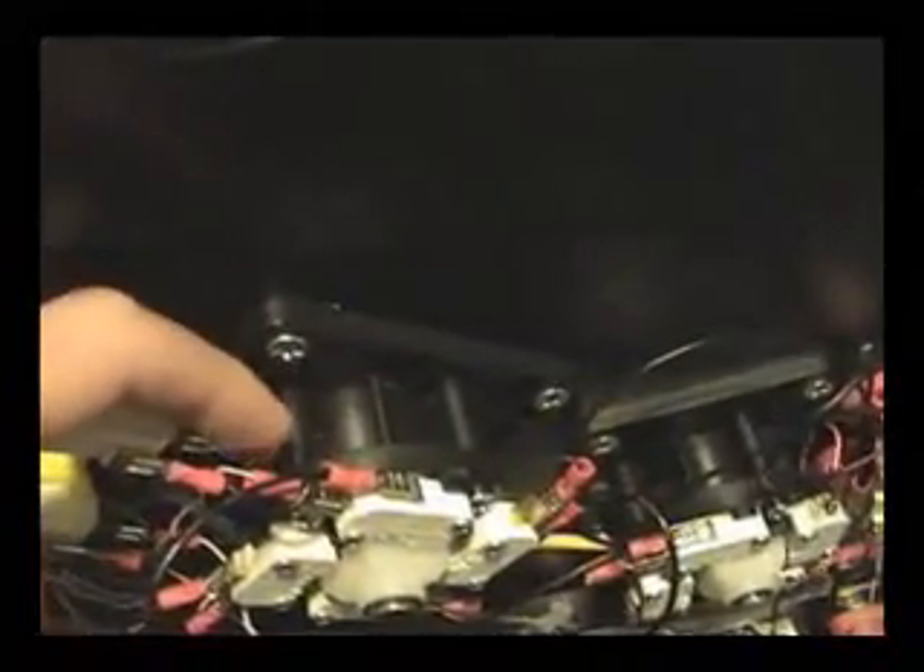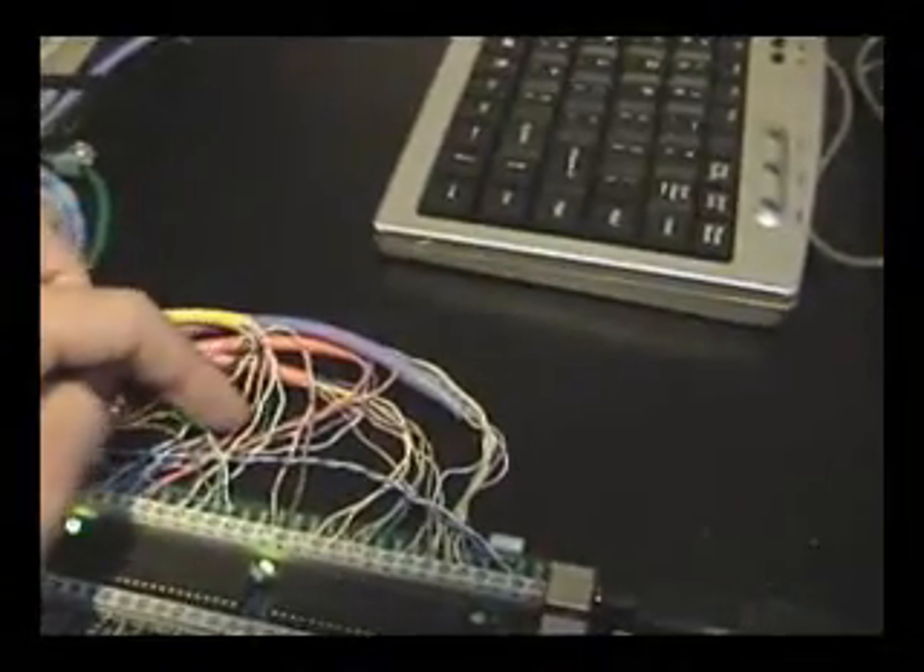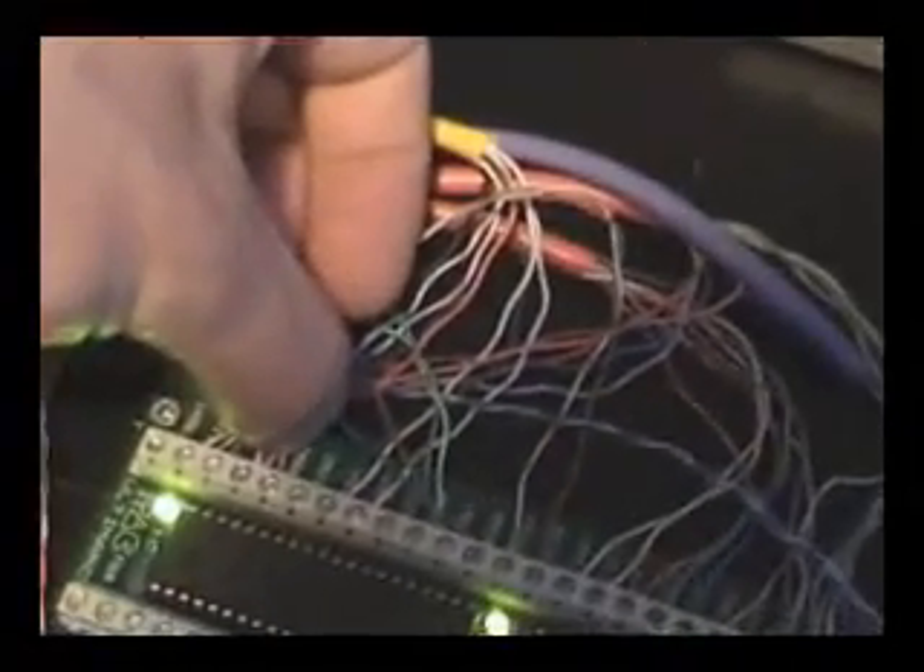Let's say you want to do button number one, which is this one right here. Now that everything's done with the ground, you want to get the pin — that's the pin you want — and that's connected to the yellow wire. In my case it would be the orange on the yellow wire. So you follow the yellow wire down, and for player four you can see orange is right there. The orange wire is going to switch one — it says SW1 and SW2, and it actually has a number four in front of it, so it says 4SW1 and 4SW2. You want switch number one, so it's as easy as that: one end connected to ground and the other connected to the switch on the board.